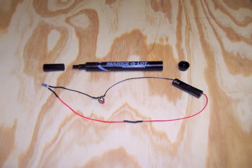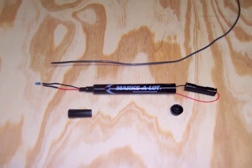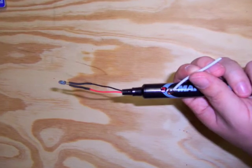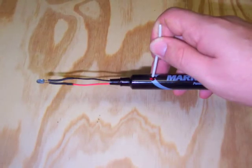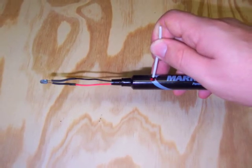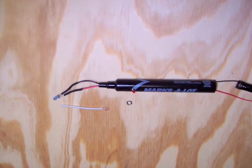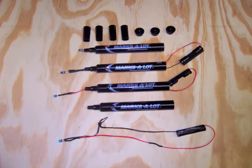The completed circuit: battery to switch to LED and back to battery. Pretty straightforward. Put that through the tube of the marker case and shove that with a wire, then create a little hook out of some wire which you can reach down through the hole. Pull out your switch, and finally that little nut that comes on the switch — make sure you pull that off before you pull it through so you can pull the switch back through and tighten it up.